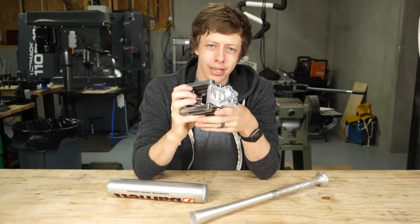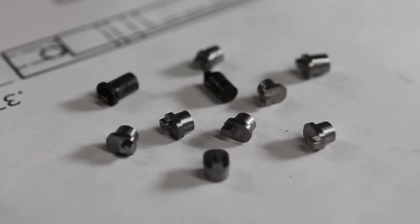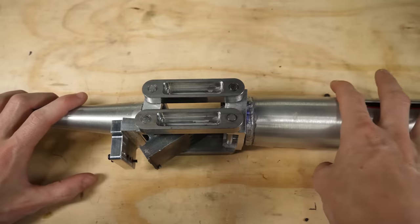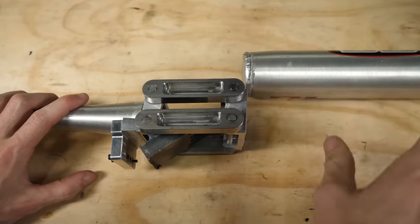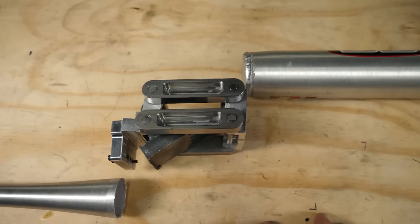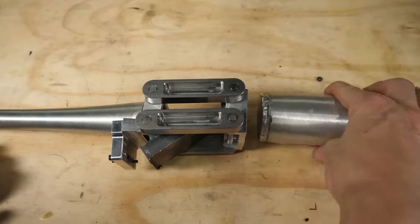I'm especially not going to get into the benefits of four separate firing mechanisms or the 12 iterations of the firing pins before I could finally get it to fire reliably. There's a really basic physics problem. For this to get launched up really fast and hard, there has to be an equal and opposite reaction forcing the handle down. This also generates a twisting force, which is what snapped the welds.